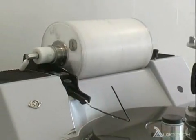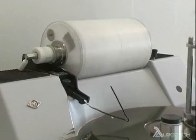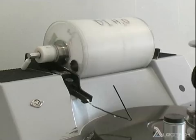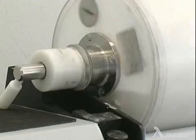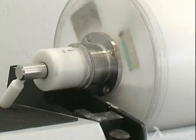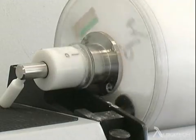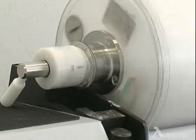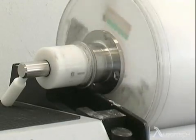The abrasive auto feed system ensures a controlled flow of slurry from the abrasive cylinder to the lapping plate via an adjustable slurry chute. The optional infrared drip detector automatically stops the plate rotating when the cylinder is empty or the valve is closed, thereby avoiding any damage to the specimen by running it on a dry plate.